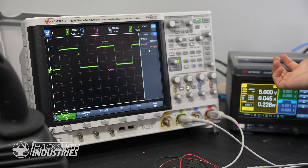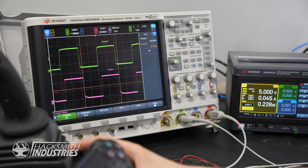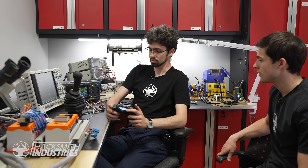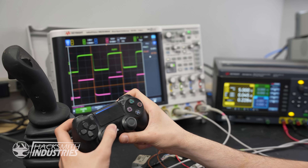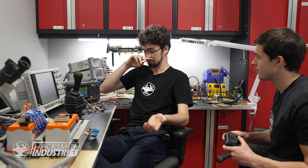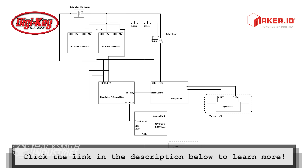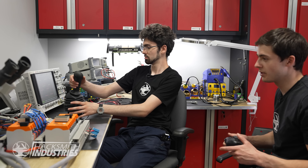I grabbed one of the joysticks from Caterpillar and hooked it up to our Keysight mixed signal oscilloscope, and the signal looked like a square wave with a varying duty cycle for the control input. Since that's a fairly simple waveform, I was able to replicate it directly on the KunBus system, and we get basically the exact same waveform. Just by holding these two buttons we can control the duty cycle exactly as we would with the joystick, and in theory they should plug directly into the Caterpillar. If you'd like to see the full schematic diagram, check out the maker.io link in the description. That means we're ready to test — let's go do it.